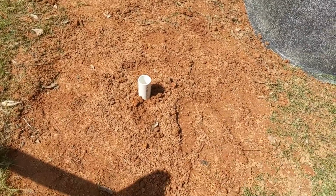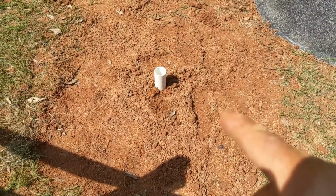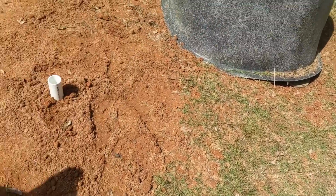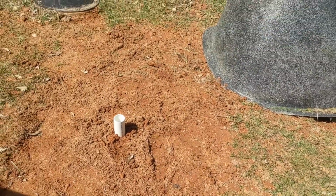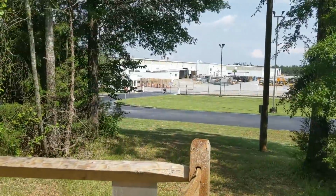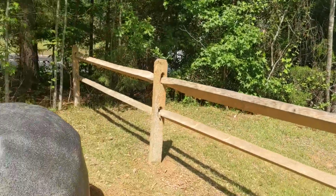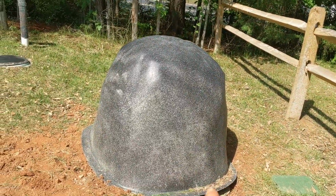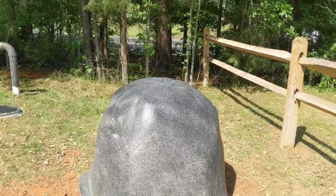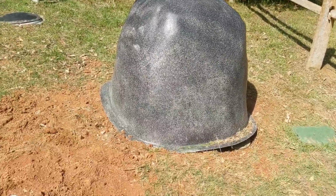Anyway, enough whining. So the bladder tank worked great. It was on the right side of the pressure switch versus the wrong side of the pressure switch. Usually in a conventional system, if they're close enough, it doesn't matter, but on this one, it was really sensitive to it. So we just ran all their irrigation zones, tested every one. They all ran the same cycle time between turning it on and turning it off. And then we doubled some zones up to 20 heads, and it held 55 psi all day long.